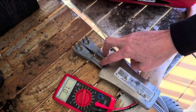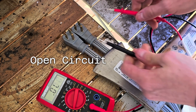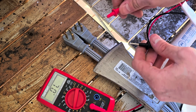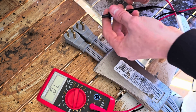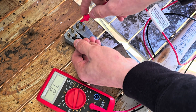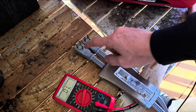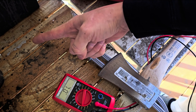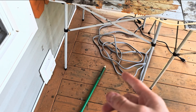After you've cut the female ends off both drop cords and tied them together, make sure you've got it wired correctly. Using continuity mode — this terminal should go to that one, this one to that one, this one to that one. We test: goes to zero — those two are wired correctly. Left terminal goes to zero, right terminal goes to zero. The drop cord is wired correctly. One end goes into the generator, one end into an outlet in the house.